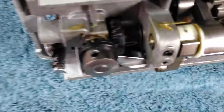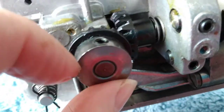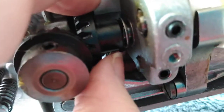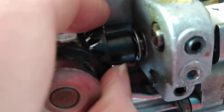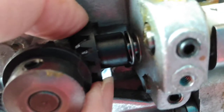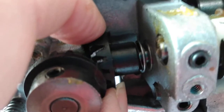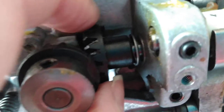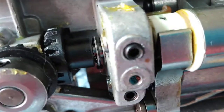When I watch the videos on replacing this gear, you just undo these two set screws, pull it off, and put the new one on. It shows this gear as having set screws on it also, but mine doesn't. You can spin it all the way around and there's nothing in there. What's happening is the drive shaft is spinning and this gear is only turning part of the time — it's like it's not tight enough on the shaft.